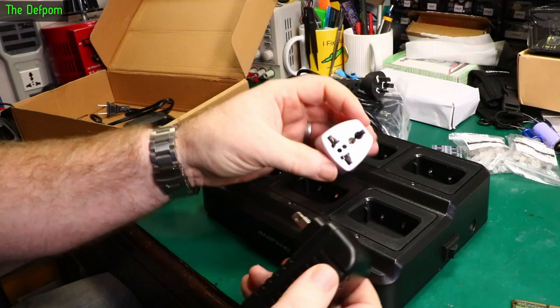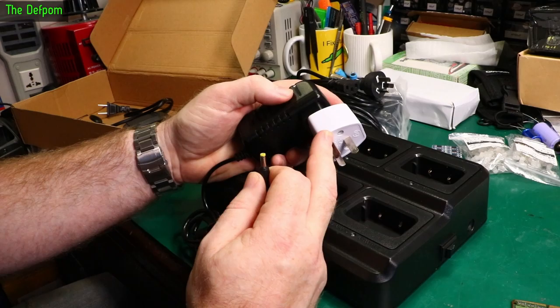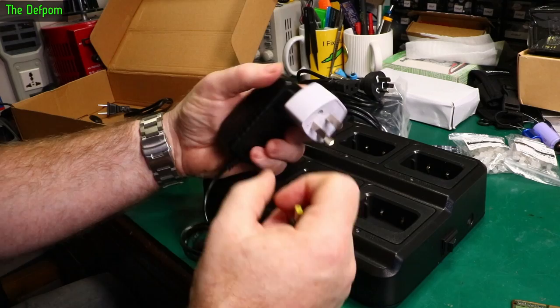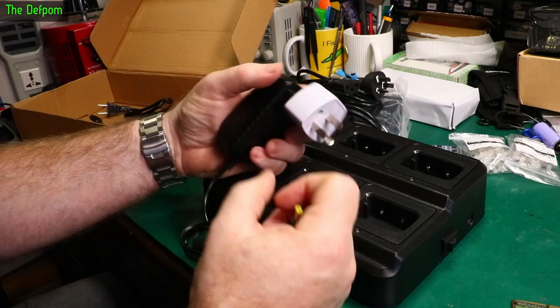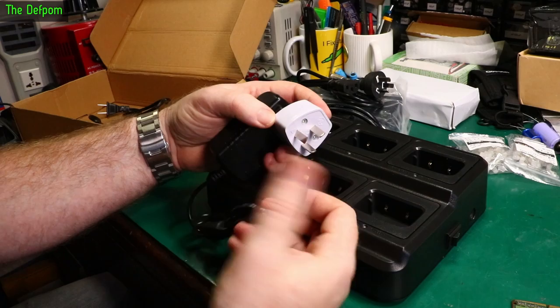Seriously, only ever use these as a last resort. Don't use them long term — these things are dangerous. That's why they're called death adapters by Big Clive. Hey Clive, I know you watch my videos sometimes. If you've got these things, don't rely on them. If you need to use one, go and buy another charger — seriously. You cannot trust these things. This one is a nice tight fit because I've opened it up, squashed all the metals together and made them a tight fit. They won't stay that way. You also get different qualities of these — they look exactly the same, but sometimes the metals are slightly different thicknesses, and the ones that are slightly thicker are better. But a lot of them are actually garbage and dangerous to use.